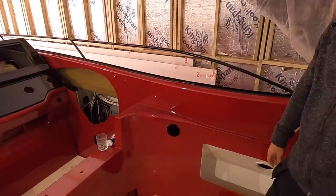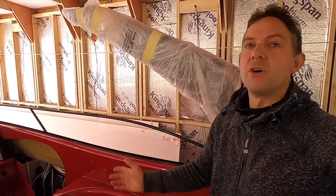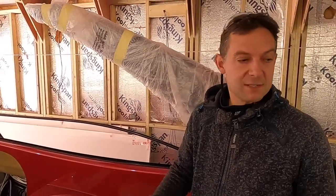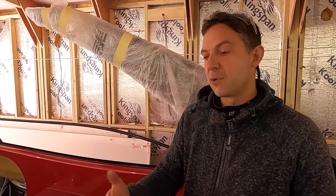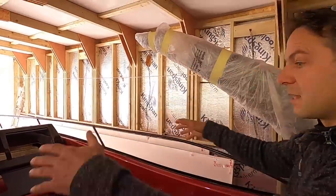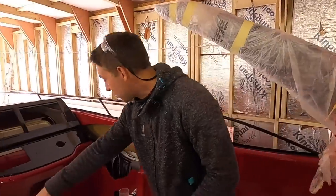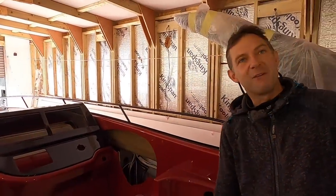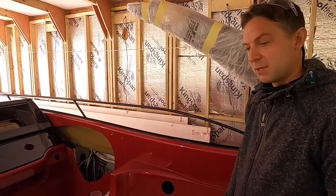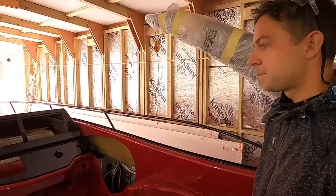The cockpit is spray painted. This is probably the most difficult part — painting the side of a hull is a big flat area at the right height, but in a cockpit you've got lots of intricate places where product can build up and form runs. Moving around in here and through the back of the boat with the airline, trying to do all of this and go around the corner without the airline or your overalls touching wet paint — really quite tricky. But it's come up really well — it looks flawless, and a lot of it hasn't been polished yet, this is just a gun finish.